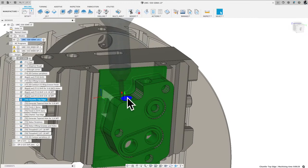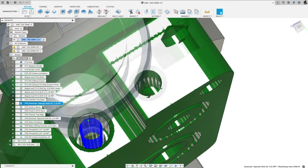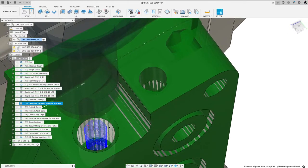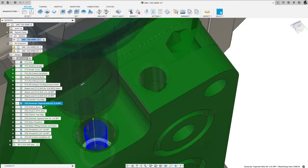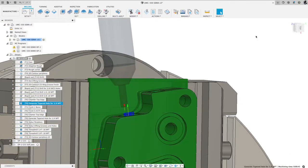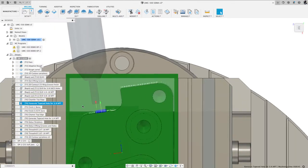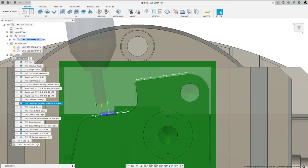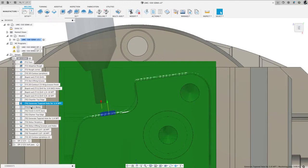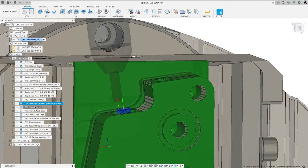So after I generate that chamfer edge, this actually went all the way down, and you could see it machined that bore there, and it's tapered. So I didn't have to get any special tool. I just used a standard bull nose end mill that had a little corner radius on it. Let me zoom in. You can see there's a slight corner radius on that tool, and that generated a super, super smooth tool path. And then I did the same thing